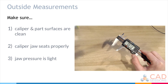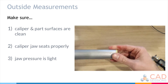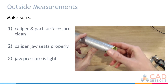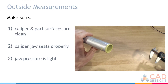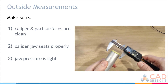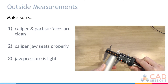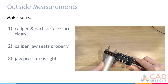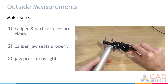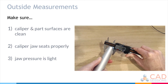Next, let's say I wanted to make an attachment for my vacuum cleaner — some 3D printed adapter that changes the shape of the nozzle. For an outside measurement, I come in here and take an outside measurement: 1.2505. Notice I want to make sure I'm not wobbling — I need a firm, good seat on the part.